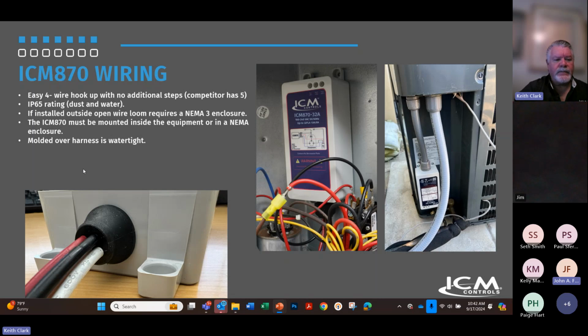If you need to mount it outside, what we're doing right now, Keith, is we're recommending a junction box, an IP67 rated outdoor enclosure. There's a specific one I've been recommending because it's just such a nice one, made by Sapewell, and it has a nice clear plastic door, and you just mount it in there. You see here a nice picture of the seal tight whips. Of course, you could mount it that way as well, with the seal tight whips, and we don't generally recommend it being mounted upside down, but if everything is sealed tight, then it shouldn't be an issue. That's all we have right now as a solution. Eventually, going forward, I would assume that on the next generation, we'll probably incorporate being fully weather resistant and get that NEMA rating that we need for the outdoors.